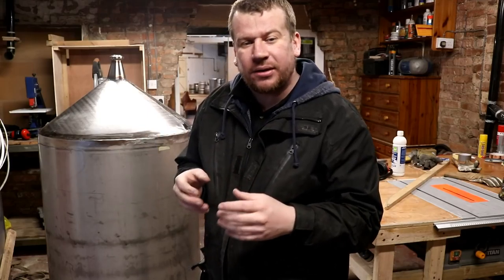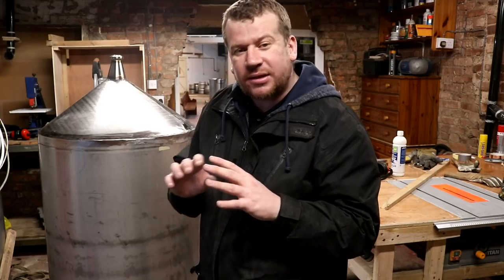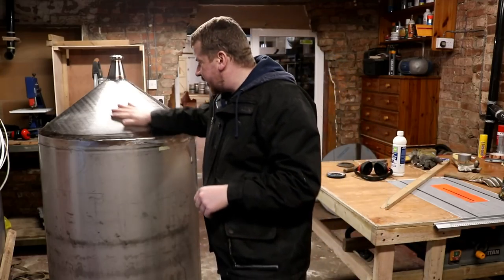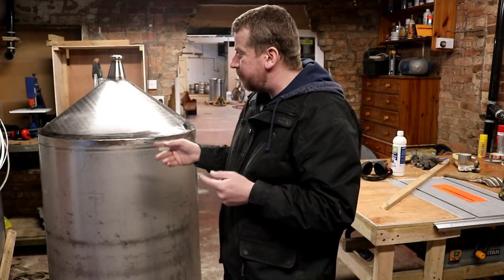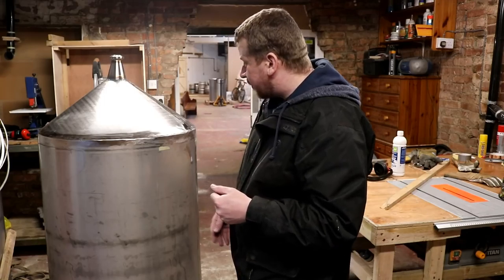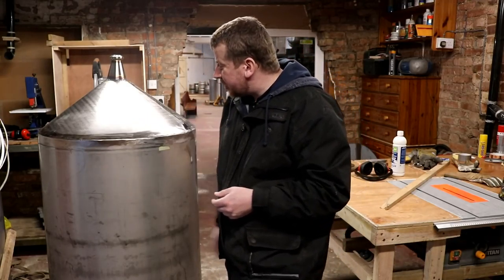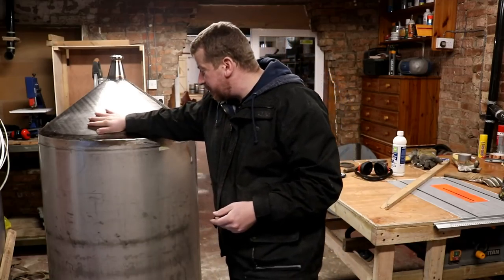We've got to go in there and pickle all of the welds to remove any carbon or discolouration. Once that's done I'll really be able to get a good idea of what all the weld seams are like - a close inspection with no dirt and grime on top. Even though I've got dull polished stainless on the inside, the next time I order steel I'm just going to order the descaled stuff. My other tanks were that finish and we never had any infections on the big kit - not one. It's more down to your cleaning regime than worrying about a scratch or pit in the surface. Just clean it properly is all I'd say.